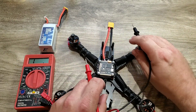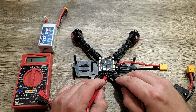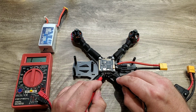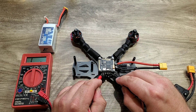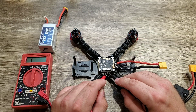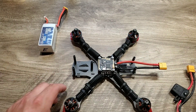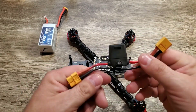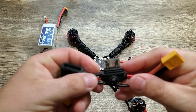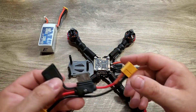You can do the same thing with the ESCs — take one of your motor pads and touch it. You can see this system reads as connected, which is good because those are one motor's pads. If you do the same thing for a different motor, you get no reading, and that's good. A reading between two different motors means solder has bridged between them. Now that we've done the multimeter check, I'm confident it's okay to plug in power. For an added precaution, go ahead and get a smoke stopper — this one uses a two-amp fuse, and if anything is shorted and takes more than two amps, it will blow the fuse before damaging a component.